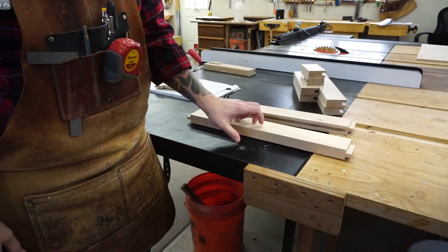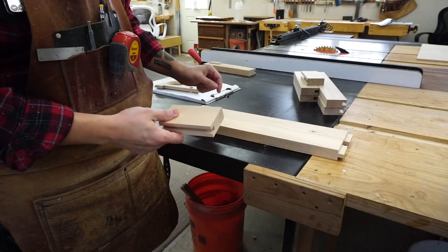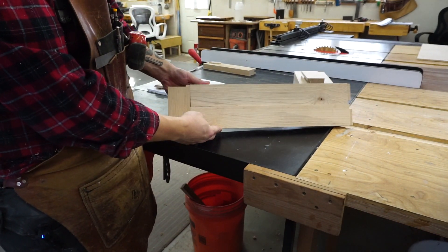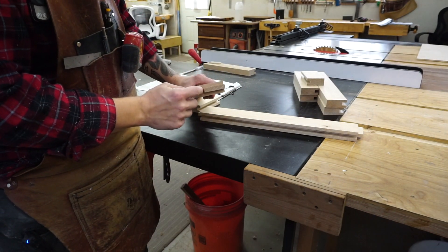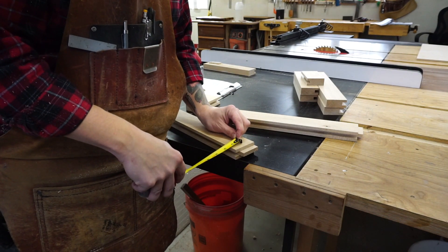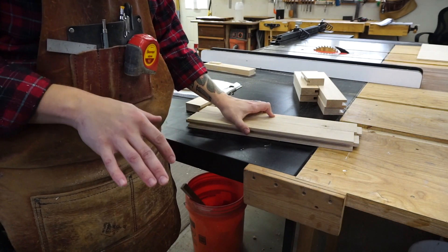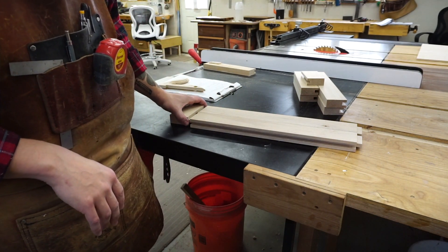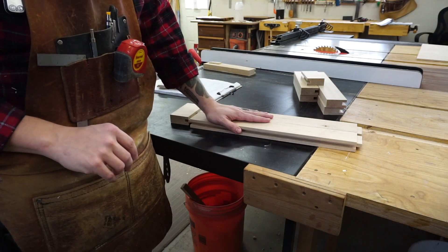So here's a good teachable moment. We have our rails — our top drawer is four and three-eighths high — uh-oh, no room for a panel, it's actually too big. So what we're going to do is rip a portion off this side. We're going to leave the dado and rip these down to probably an inch and a quarter, that way we have a small panel on the inside. Obviously if you're building furniture you don't want to lay things out this way — this is kind of just how it worked out for the shop. But follow good design proportions — we wouldn't be using these sizes in real life. So we'll rip these down and we can measure for our panels.